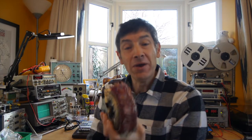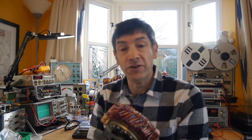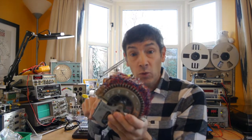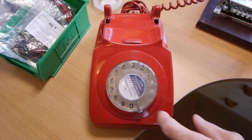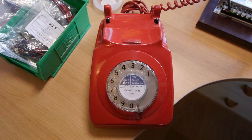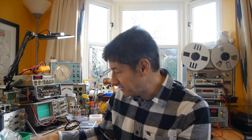So there's quite an interesting story behind these Strowger switches, and they probably won't be familiar to many of you. But back in the day when you used to dial telephone numbers, these would be in the exchanges, and they would be clicking round and round as your dial went round and sent pulses to select the number you were trying to dial. Before these were invented by Strowger, what you did was you picked up the telephone and you asked to be put through to the operator, and they had a big wall in front of them with all the numbers that were available locally, and they would pick up a plug and plug you in to the number you wanted.